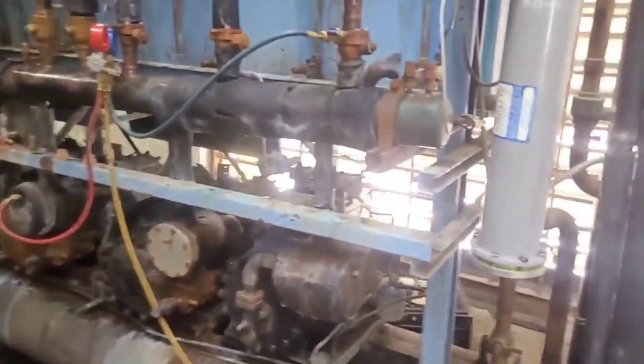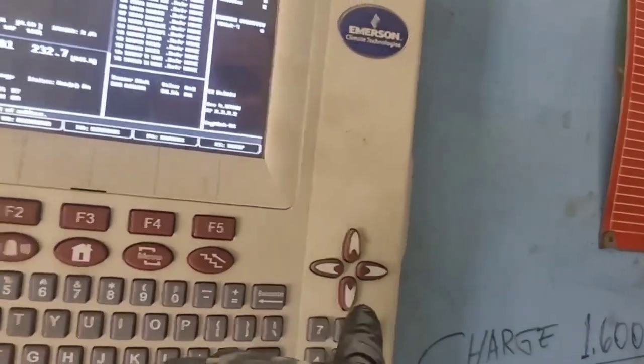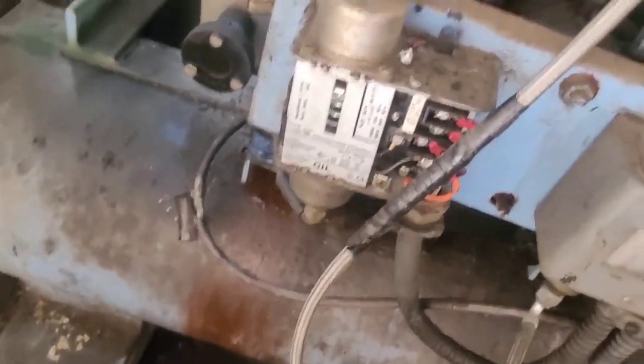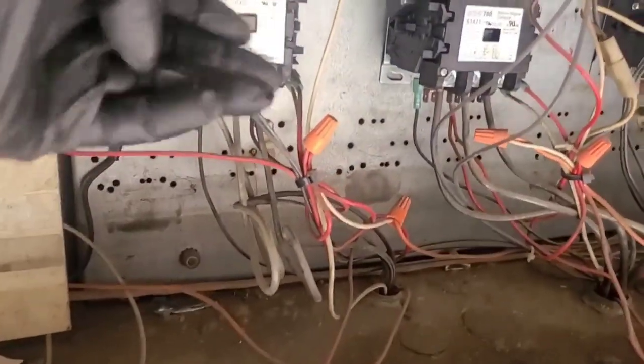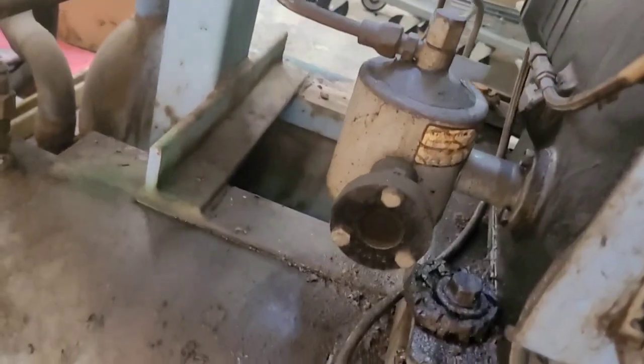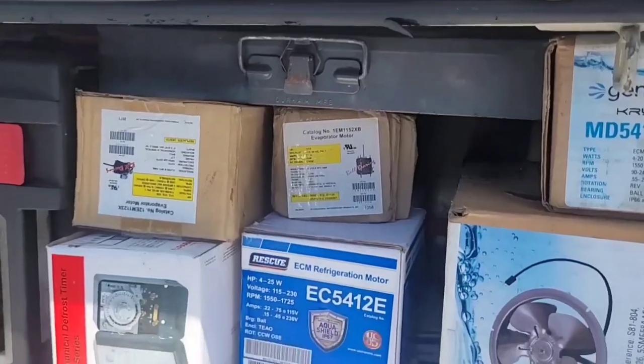Let's go see. Also, while I'm doing all that other stuff, I'm working and monitoring this rack. This rack we got, it's not doing the greatest. This contactor's not working very well. It chatters on startup. This thing right here, it's faulting on oil. I think it's oil. Yeah, lube, tech control. I gotta hit that button, but when I hit that button, this contactor chatters and doesn't start. It fails to start. But I can push it with a screwdriver and push the button at the same time and it starts nice. Meanwhile, the oil level in there stays full. So I'm learning on this one, but I got that going on the back burner. Not making a video about that one right now. We're doing the cake cases on the north corner of the store. All right, I think that's what these are.